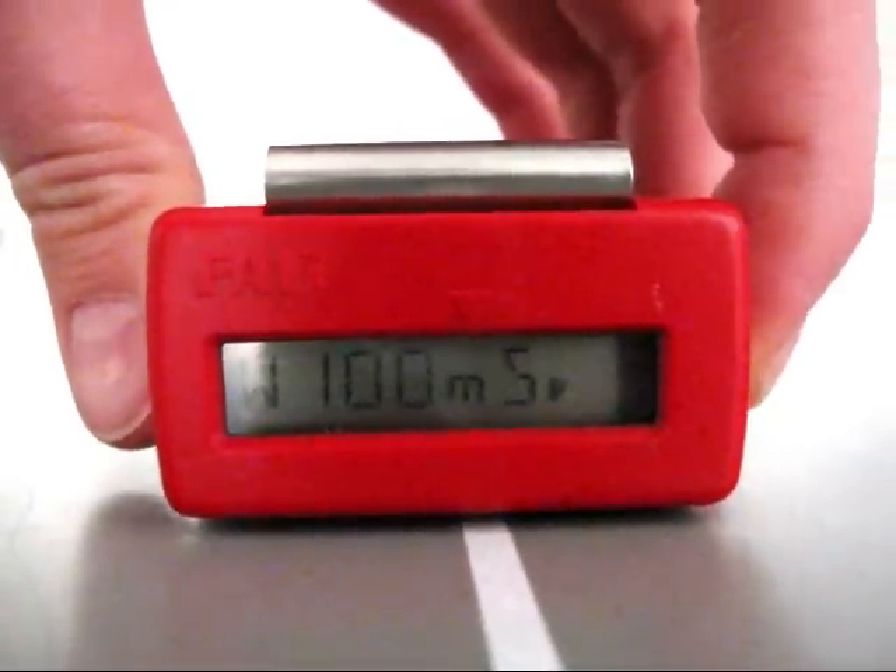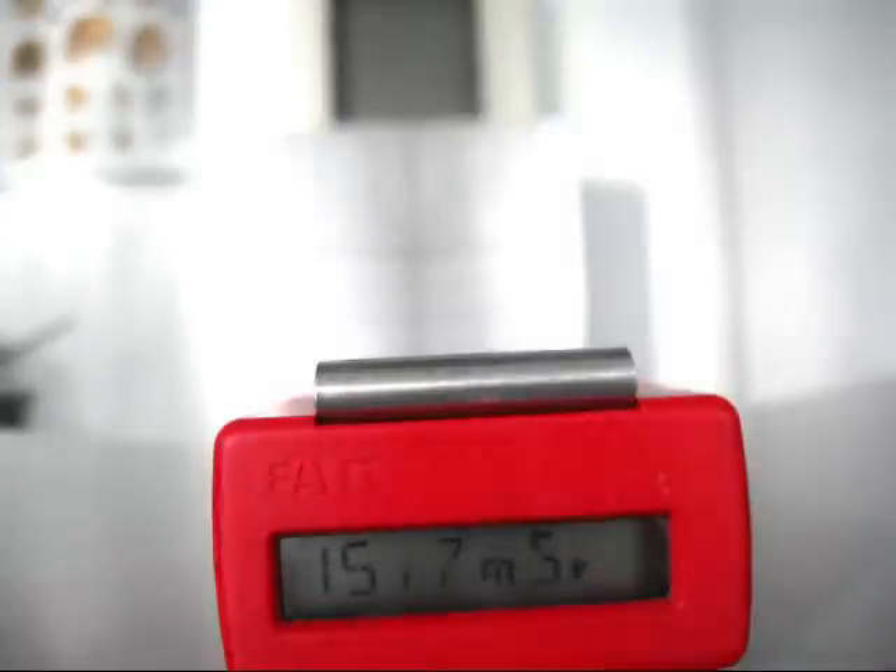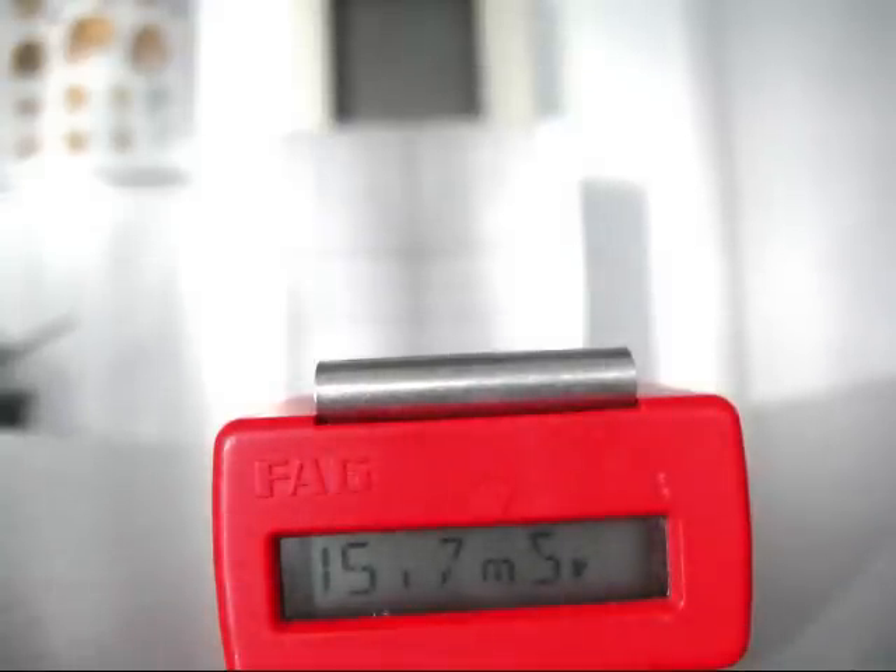Just setting it to the next alarm level of 100 millisieverts, but I'm not going to do that because the tube would overheat. At these settings, we are at 105 centimeters away from the tube focus — approximately one meter distance — you would get a dose rate of 5 sieverts per hour. So in theory, 30 minutes in one go would make you dead sick with radiation sickness. Of course, nobody is ever going to X-ray you for that long, and the tube would shut off before that could happen anyway. It just tells you that you really shouldn't mess around with X-rays too much unless you've got a safe room with lead glass and everything, like I have here.